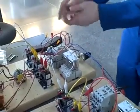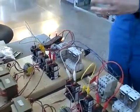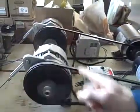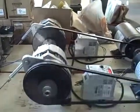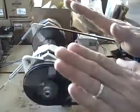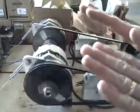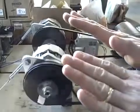Closing the breaker will close the circuit and parallel these two generators, at which point they will be electrically coupled together. Then we can check the tape — right now this tape is rotating backwards, but after we synchronize it, those two pieces of tape will look like they're locked in the same place. That will be the physical proof that we have these two generators synchronized together, acting as though they're mechanically coupled even though the only coupling here is electrical.